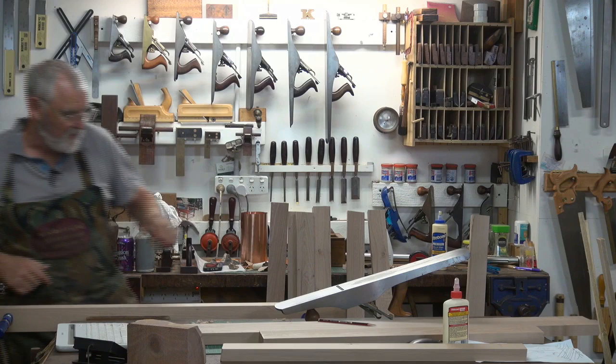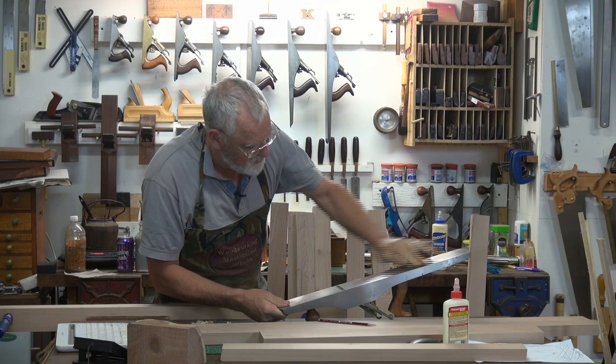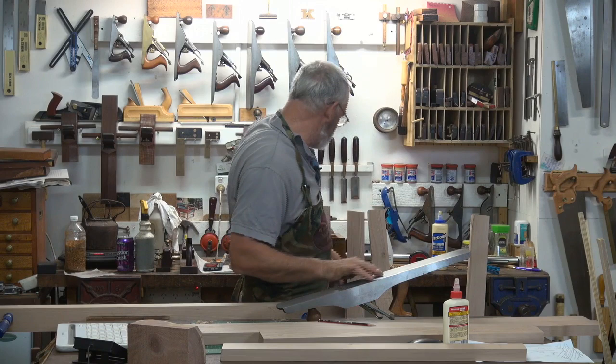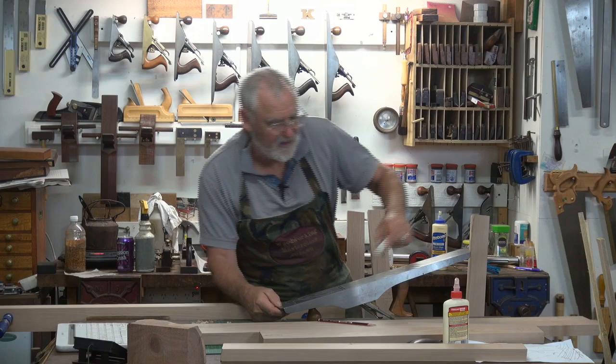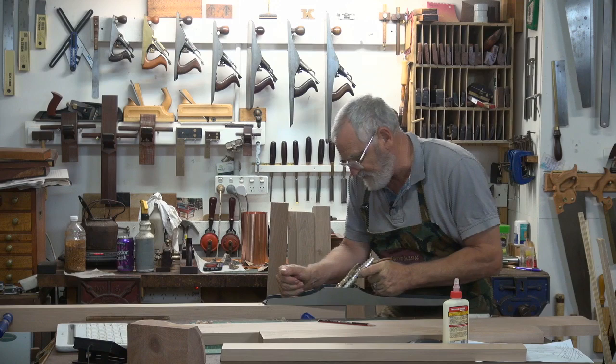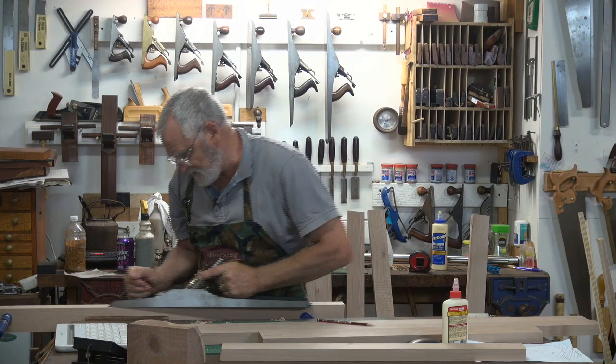Let's take all that wax off. So I just put on there. This is Scotch Brite, so I won't hurt it. Okay, so rewind on that last piece: do not put wax on the back of the plane, put it on the front of the plane. The reason being, it would allow the plane to still glide, but the wax being laid on the timber will be taken off by the blade, and therefore it won't affect the gluing process.